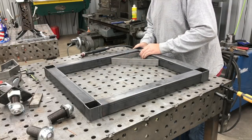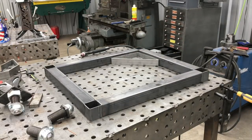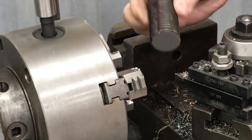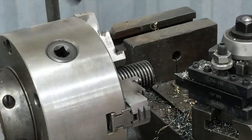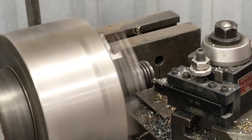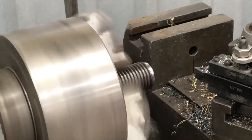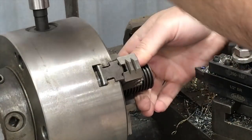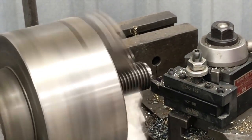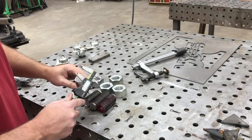Here I'm using the Reed Eichner supplied Fireball Tool squares. He sent me a couple of different ones and these really are handy tools. Over on the lathe we're making the leveling feet — these are some off-cut one and a quarter inch bolts that I use on those table kits that I make and sell. What I'm doing here is turning down the end a little, about an eighth inch shoulder, that will get rid of the threads and create squareness. Those threads have some coating on them and I'm turning that off.